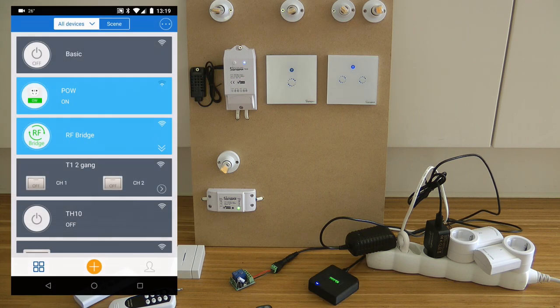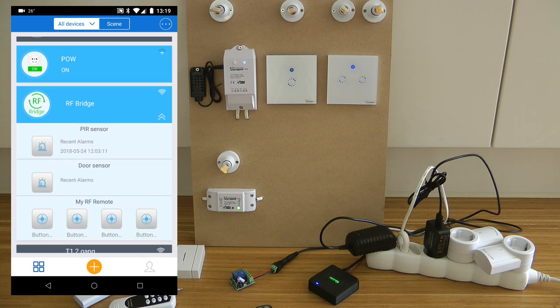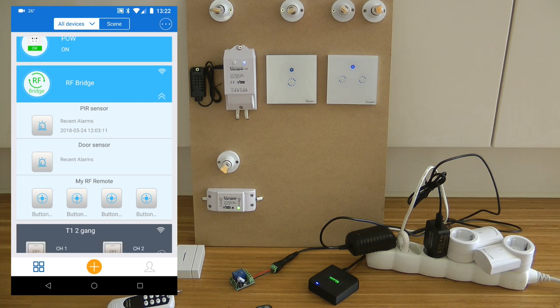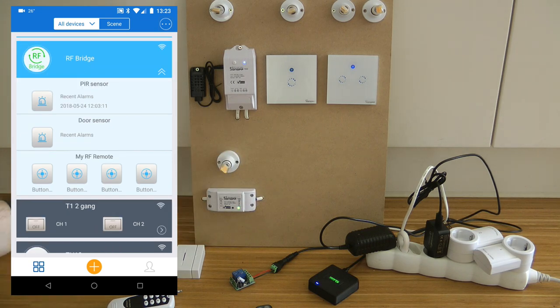If you go back to the main screen, you see you have the RF bridge now and it's connected, and you can click on these up and down arrows to operate each of the sensors or devices within the RF bridge. And so one way to use the RF bridge is to control your old RF sockets. For example, I have this one here, so that's already paired with the unit. As I've shown you before, I have already paired this unit with the RF bridge,